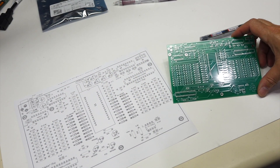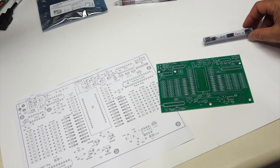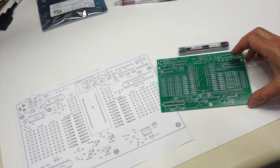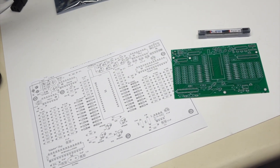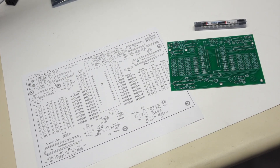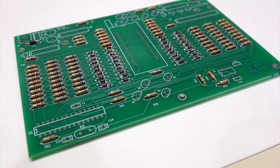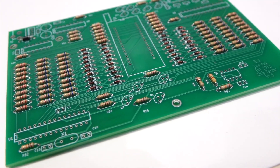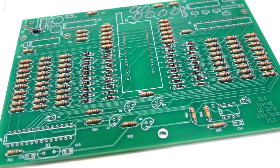So this is a Tauntek logic IC tester — that's what Josh used for testing TTLs to repair the Digibarn Alto. It's a kit, really a minimum kit. You just get the board and the two programmed PICs, and then you have to buy all the other components and do it à la Heathkit. This kit is a lot of resistors and diodes, and the reason there are so many is a very good one: the board is able to measure the voltage of each pin under different load conditions, allowing it to ferret out marginal parts that would otherwise pass a simpler tester.